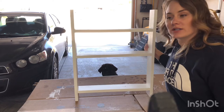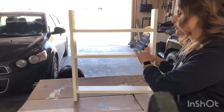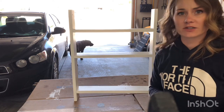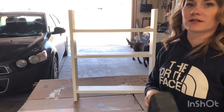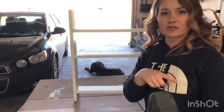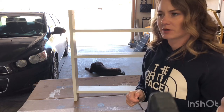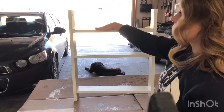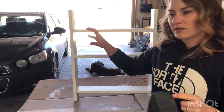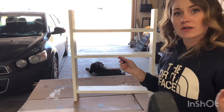This has had a couple of hours to dry and cure — I had to go to the grocery store, so it's a little longer than I normally would have done this. It is dry to the touch, not tacky, although if I scrape my nail on it, it does come up pretty easily. I'm going to be using my palm sander for this. A lot of people just hand sand it, but I hate sanding, so the palm sander makes it go a lot faster. I am using 120-grit sandpaper that's been used before, so it's not a super coarse grit. I'm going to hit the whole project with the sander but really focus on the edges — not going so deep that it shows raw wood. I want to see that stain come through.